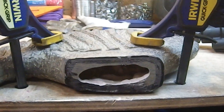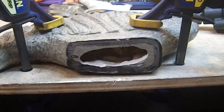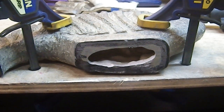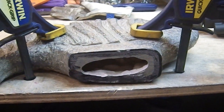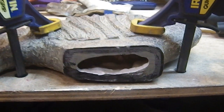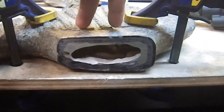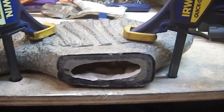This somewhat regularly shaped hole is actually working, so I can now get the shaft into the depth I want. I put a mark on the shaft and it's just shy of that, which is fine with me. I'm going to put some epoxy on the inside edge here, slide it in, drill some pilot holes, and then put in two wood screws. I need to figure out what size wood screws I need — I've got a couple of different size star drives. Once I have that in there and drill two of them in, that's going to hold this thing in place.